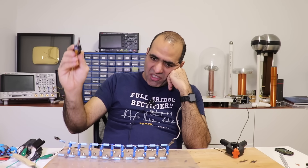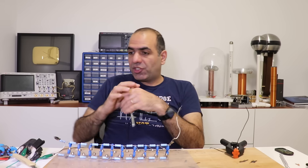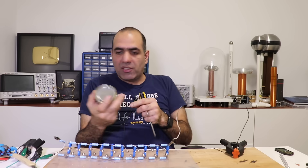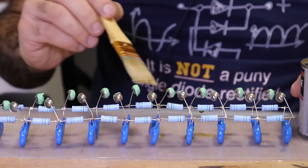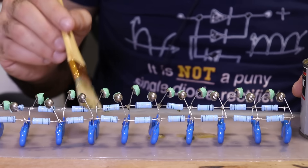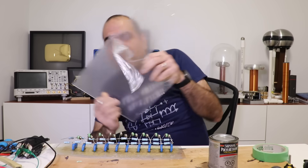It's not bad. Just makes me a little bit sad that I can't supply a higher voltage to make an even larger arc, because my resistors are not big enough and it will just arc across them. But I have another trick — I could cover the entire circuit with polyurethane for better insulation, the stuff I put on my Tesla coil. I cover the front of my spark gaps with masking tape to make sure they remain exposed. Then I cover everything, especially the exposed metals, with my polyurethane. I put five coats on, but it doesn't look like much. Hopefully it insulates enough. I also want to mount it on a plexiglass so I can hold it vertically. I don't know if this polyurethane made it any better — I'm still losing a lot of charge due to corona discharge.